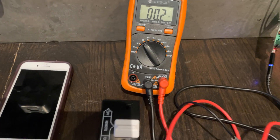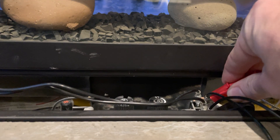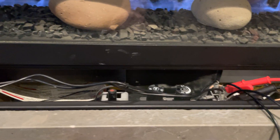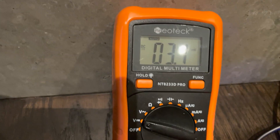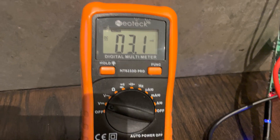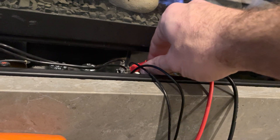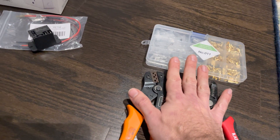So that is a very basic circuit. The other thing we can do here is determine what voltage the fireplace itself — its control unit — is supplying that switch circuit with. It'll vary from fireplace to fireplace. This one is very low voltage. We just want to double check and make sure that the relay or smart switch that we purchase is going to handle the normally open circuit as well as the voltage on that circuit. Make sure that you have a splicer, a crimper, connectors, and connector covers before you get started.